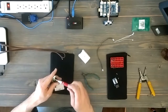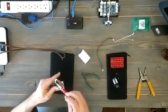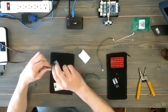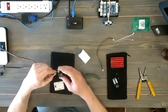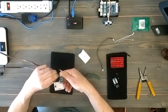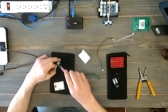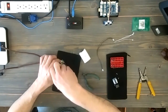This relay is normally open until it senses a voltage between three and five volts, and then it closes. So we don't have to worry about the lamp ever being on if there's no power to the device. As I put this in, I'm also going to turn it clockwise, making sure to go with the threads of the wire. A couple of turns, and I want to seat it all the way up to the insulation so that none of the copper wires are showing.